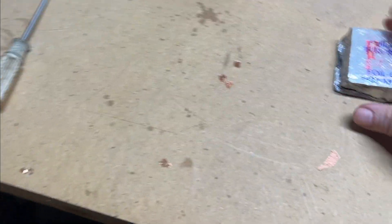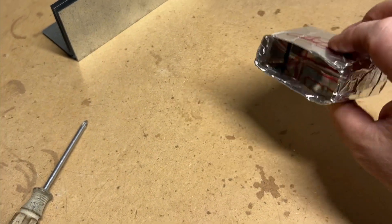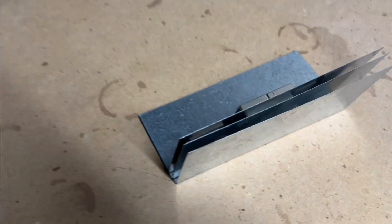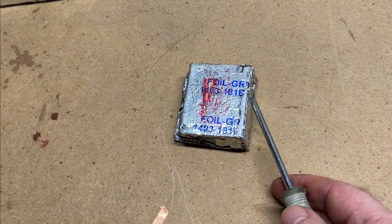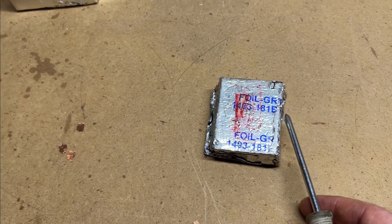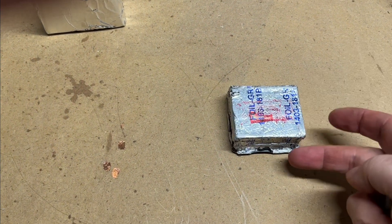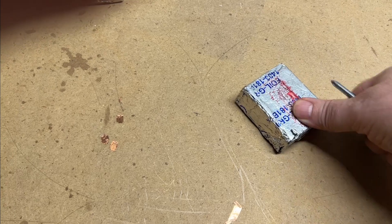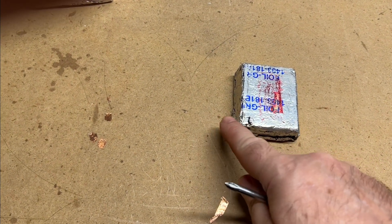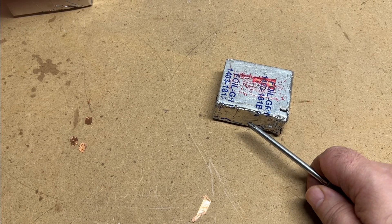Now, to show you how well this works, check this out. I claimed there's no magnetic flux back here. This is a box, like this one here, all the way around, except there's two other layers missing — those layers are over here. If you take a screwdriver and tap the back of this, nothing happens. Go to the front — it doesn't stick to the screwdriver. But if you turn this around and now you do it to the front, now it sticks. What I have here is a completely shielded magnet — there's just no flux coming out, none. If there's any, it's so little it's negligible.